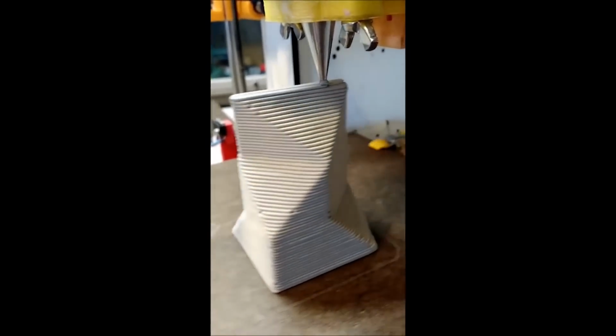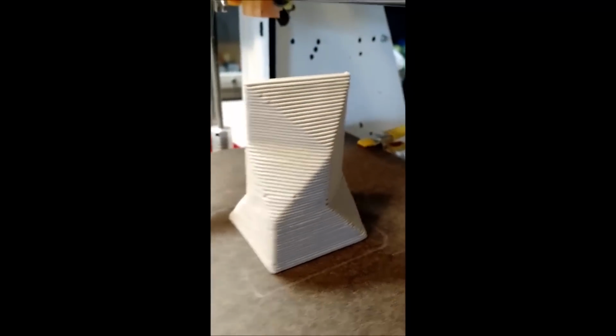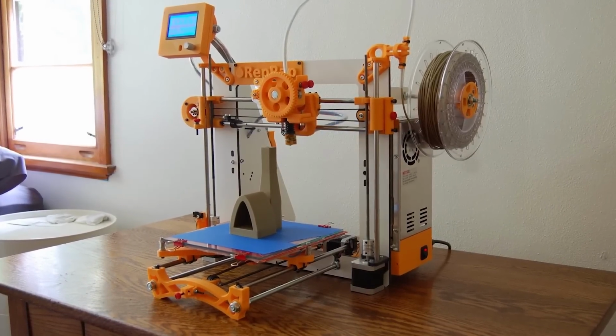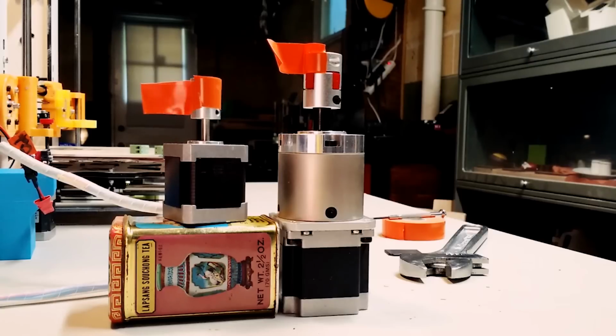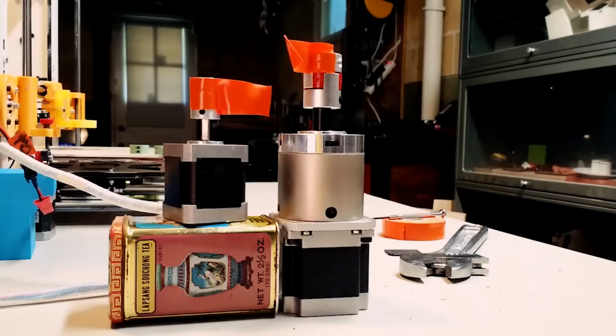For whatever reason, I just really wanted to explore a different approach to this. I didn't like, as I mentioned, the air compression, and I had already been building plastic printers in a Cartesian format. And the Cartesian format, which is a little more box-like than the Delta, was really good in my mind for the type of sculptural form that I wanted to make. And it'll sound ridiculous, but if I've done anything innovative at all with my research over the last 5 years, it's this experiment here, in which I was using something called motor mirroring to make these two motors turn in a way that is synchronized, meaning that they stop and start at the same points, but that they turn different amounts.